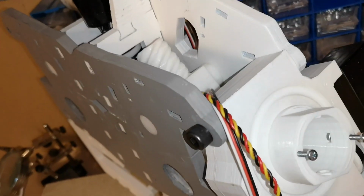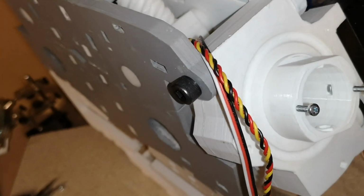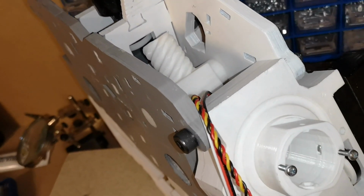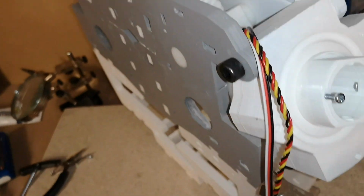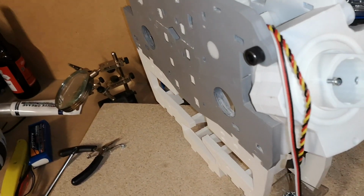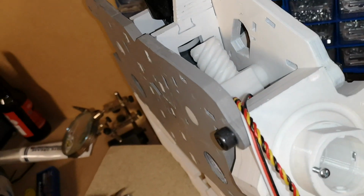I would need to attach a potentiometer, but in theory we could spin that up and see that moving in and out. We need to be very careful though, we've got no mechanical stops, so we'll just manually adjust the potentiometer by hand. We'll do the same trick as before. We'll set the potentiometer roughly in the middle, so it should be stationary when we start.